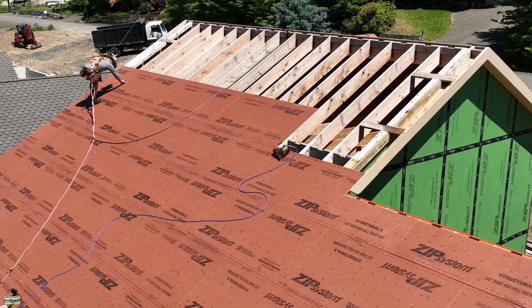One thing: as we get closer to the top, we try to lay out our sheathing to put the rip at the bottom and end with the four-footer at the top — mostly so we don't have to stop while somebody rips sheathing. We also have to divide out the sheathing so that the first or last rip is not smaller than two feet, per the manufacturers — we need our sheets to be wide enough. So subtract out however many full rows by four feet, divide the remaining. You know what I'm trying to say, even if I can't seem to say it.